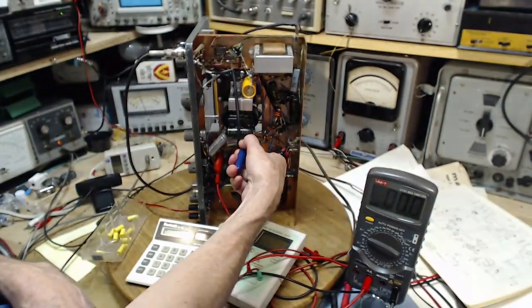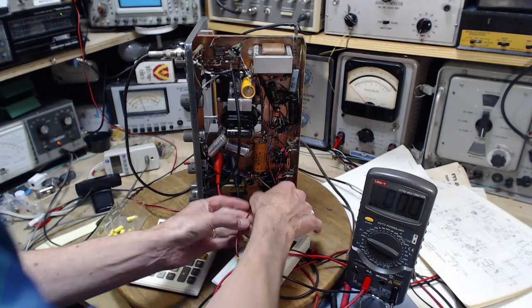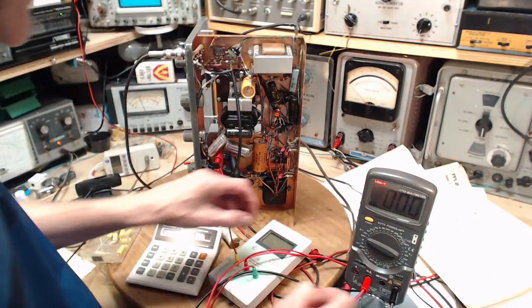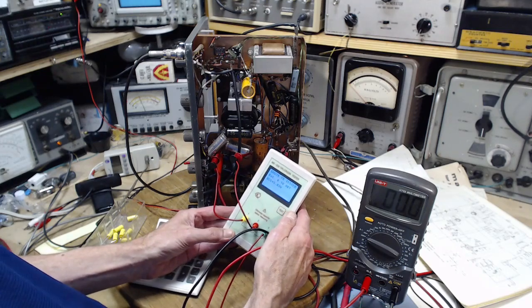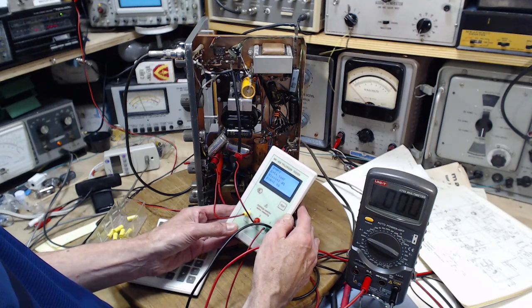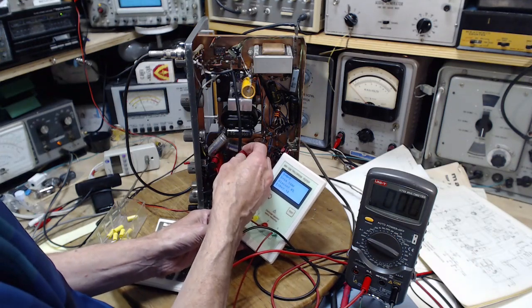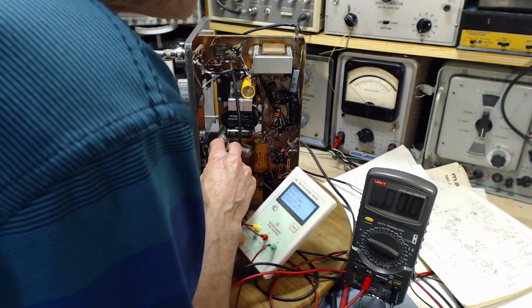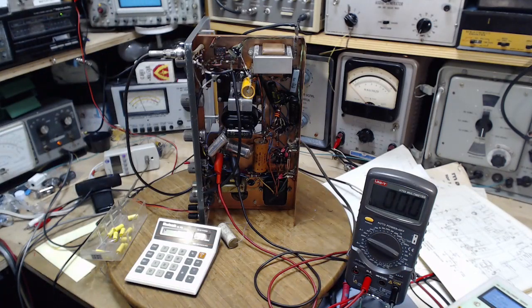Cutting here. So obviously I'm on my way to replacing this capacitor here. Oh, the sound of a wire being cut. Okay, capacitor's out. Let us test the capacitor before we go any further. Now that it's free, we'll use this big tester, or small tester here. What's it say? 50 microfarad, 2% loss. That's fine. 50 microfarad, and it's supposed to be a 40, isn't it? It's a 40. The 40 measures 50. Usually when these measure high, it means they're a little leaky, but not guaranteed. Well, that looks like this isn't going to affect anything.